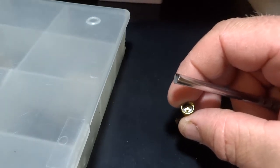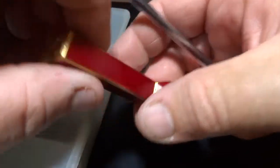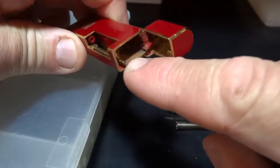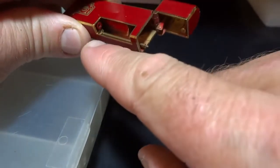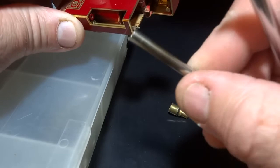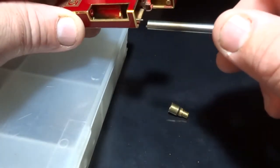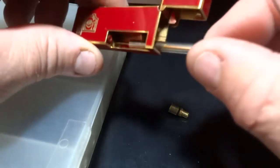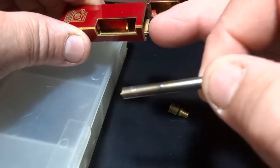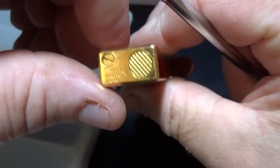Once in a while the valves won't come out, especially in these alloy lighters. This one here has been sitting for months because I've got to drill out a brass piece that'll fit over this burner valve and go down in here with a couple notches. I tried to drill this one out but couldn't get it all the way in there — it's stainless steel, pretty hard. So I'm going to make one out of brass to fit these two little notches so I can twist that out and unplug this valve. This is a nice quality Japanese lighter — a Tanita lighter. These are quality lighters.